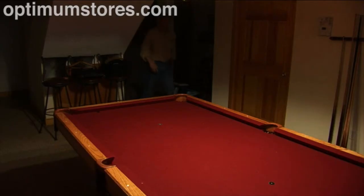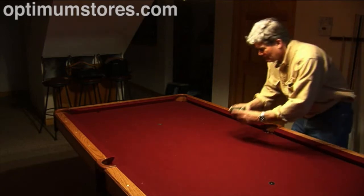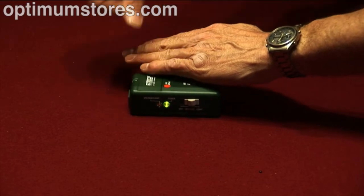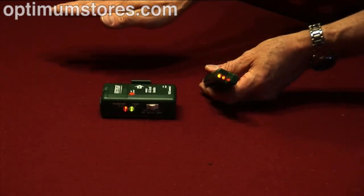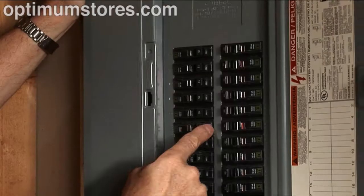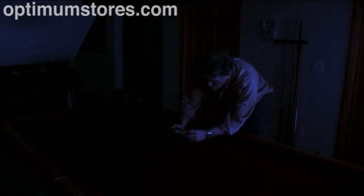When you can't access circuit wiring, the RT30 can also identify a circuit by detecting changes in room lighting using a built-in light sensor. In this mode, simply place the transmitter in a room and set it to detect if the room light is on or off. When the light goes out, the audible and LED alerts on the remote receiver will stop. Now the user can identify the right breaker or circuit which powers that particular light, without checking and rechecking if the light went out or needing a helper to check the remote light location.